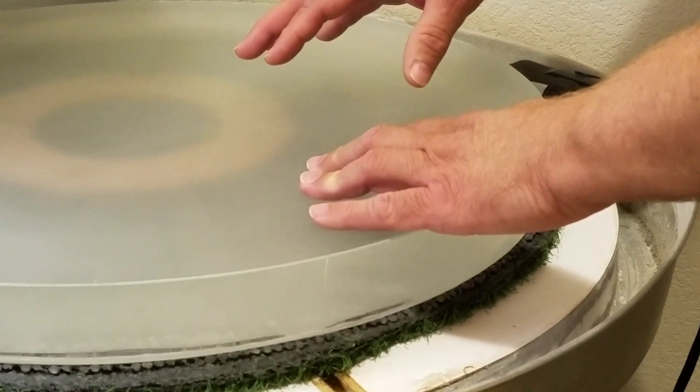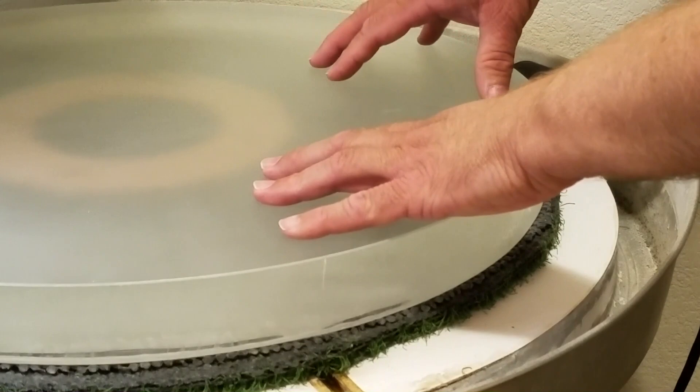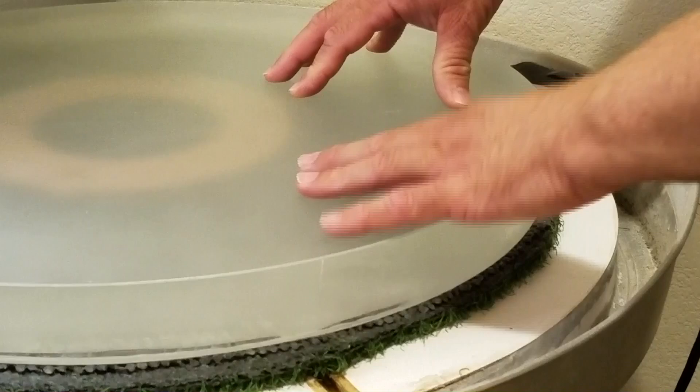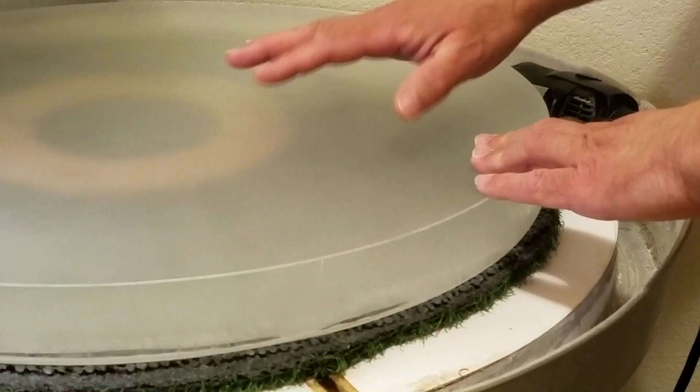It's really nice to make them that way because they're cheaper, but there's a little extra labor involved. The front of this blank is on the downside facing the turntable on the smear grinding machine, and it's a little rougher than you'd expect of a normally generated blank. On a normal generated blank you can start grinding with 320 or 25 microns, but on this one I'll have to do some rough grinding. The back, though, was run on a Blanchard grinder and ground flat — accurate to about a thousandth of an inch.